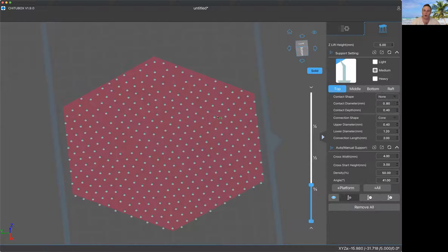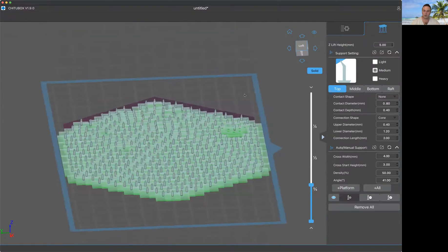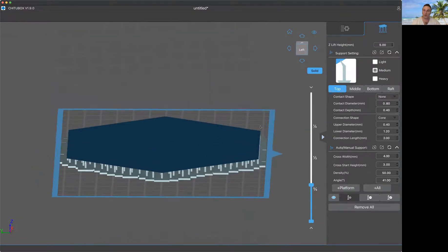It's kind of like bridging — I'm not sure if that term is used for resin printing, but you don't want that, because there's this area right here with nothing supporting it. You could try adding a bunch of supports in between, but no matter what you do, you're always going to have some messed-up, not-smooth surface if you try to have a surface parallel to your build plate.